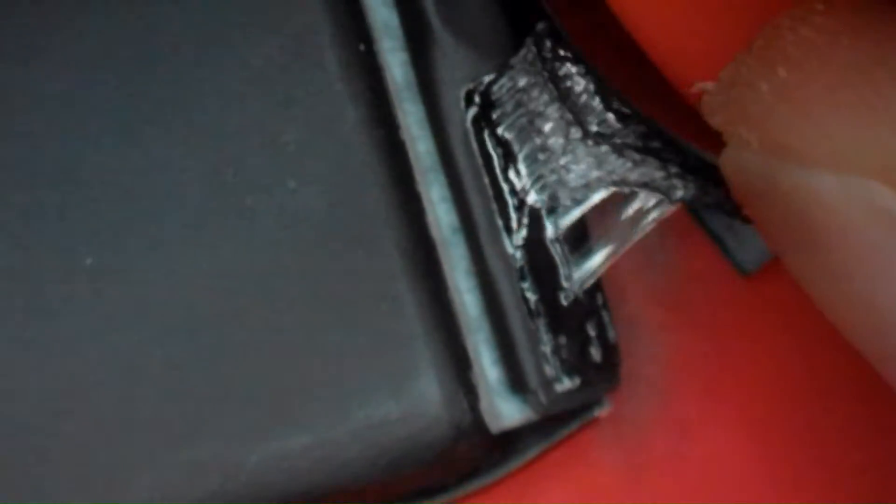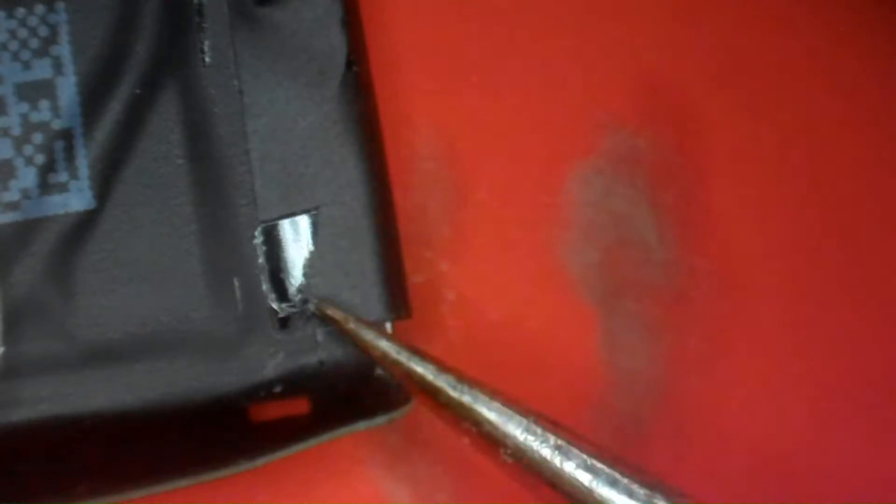After the top layer is peeled off, you'll see a black protective cover with a couple of adhesive tabs underneath to keep it secure. Pull straight up and that plastic cover will come off — you don't have to save it, as replacement covers are provided in the XCAP packaging. There's a second layer of adhesive here; the BMS is basically wrapped with this adhesive. Same thing — create a starting point by picking at the corner, then peel it all the way down the back of the cell.